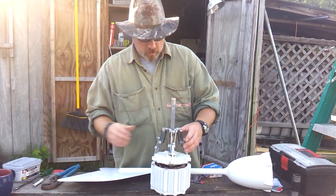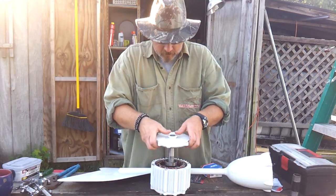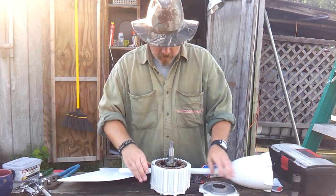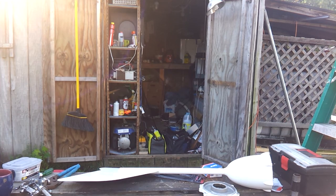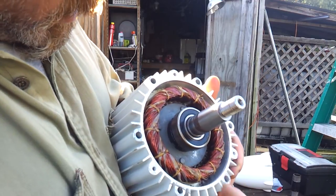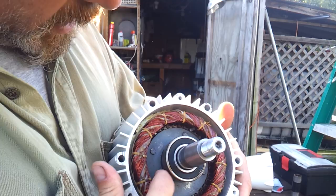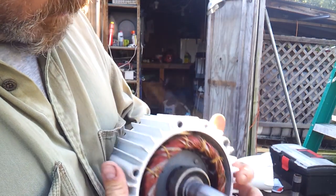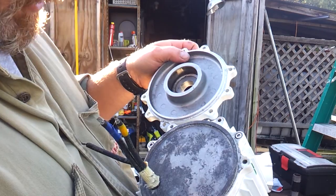Okay, so now we've got it apart. You have to pull that because it's attached to the bearing. The front nose piece — the bearing sits inside of here. In here is your stator, your windings, there are permanent magnets in here. This is the front bearing. There's also one located right here in the back, and the inside of that looks similar to this.